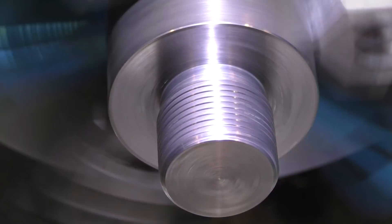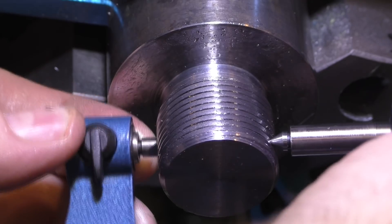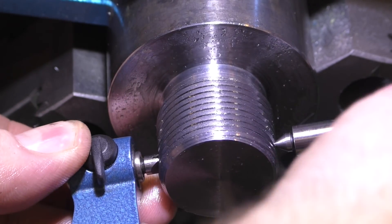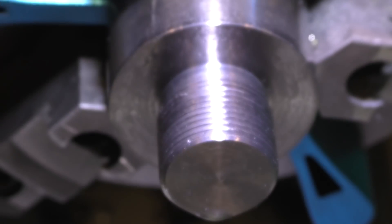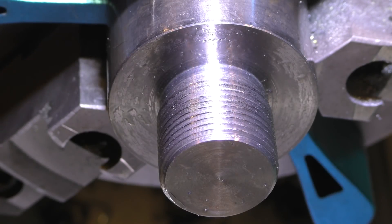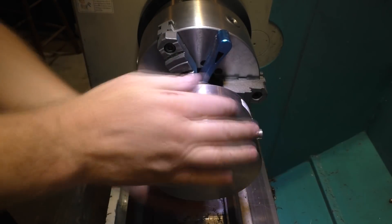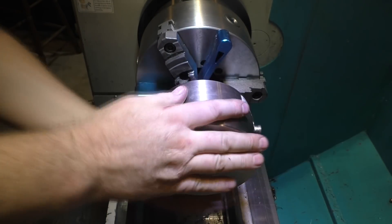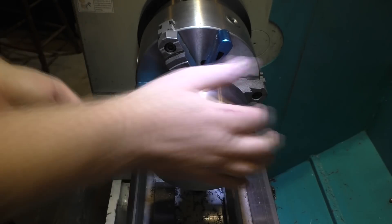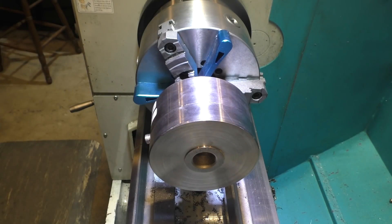Clean those threads out. We're going to take our thread pitch mic here and see what measurement we get — that should be right in there, a pretty tight fit. This is why I got the nut. Great fit — perfect, no slop. One down, one to go. Just going to clean these threads up and we'll move on to the next part. Spinning it on — it's a really good fit. You can just dial it right up until it bottoms, and there we go. Very nice — awesome fit, no rock at all. We just need to make the other one and we'll be good to go.